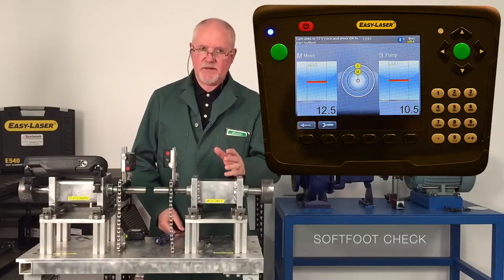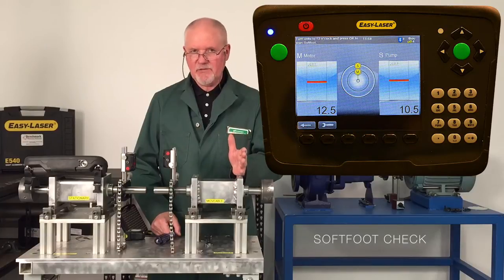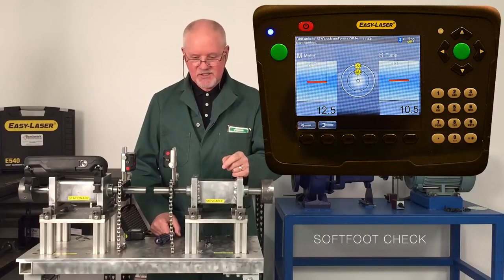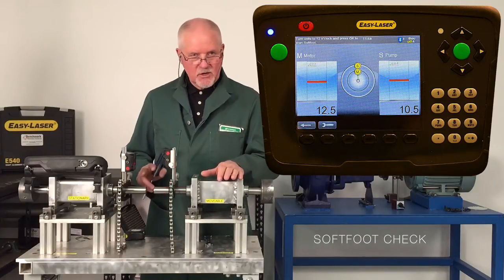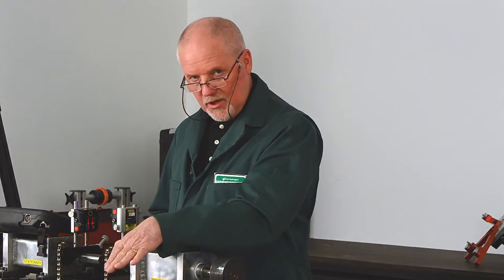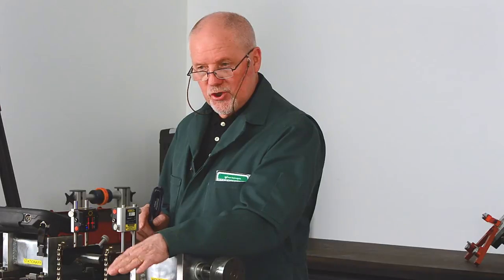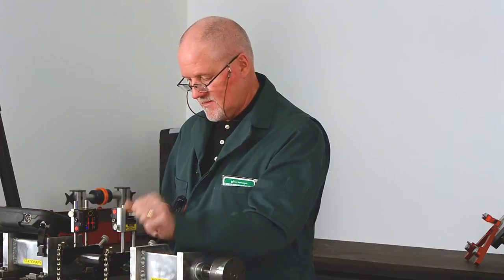A word of warning on soft foot: this is a soft foot guide. All lasers, regardless of who makes them, are only guides — you can't blindly believe the values. You have to go and check it out to be really certain of what you're measuring. The reason is lasers are always mounted on the shaft, so it's measuring shaft deflection. If the foot is at an angle, laser systems — even with a wizard — cannot measure that angle in this plane. Take it as a guide and then re-measure using something else.